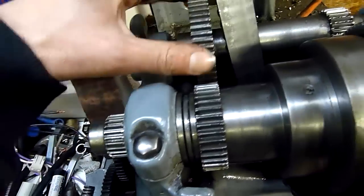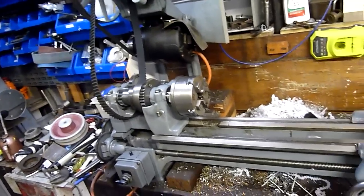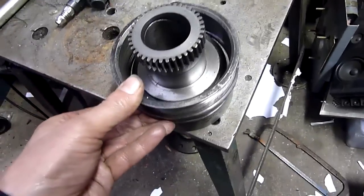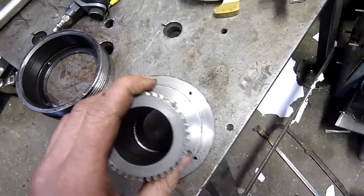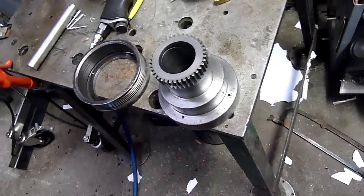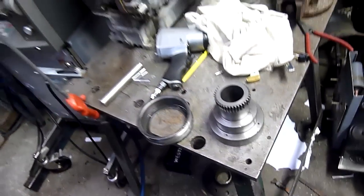Same with the back gear teeth - done a hell of a lot of work. 1941 or 1942 South Bend Indiana - it's a war production machine. I've transferred the bolt holes from the drive pulley placement and getting ready to tap them. Drilled them 3.2mm, I'll tap them M4 and use some high tensile cap screws. By the time I ram that annulus ring in there, it's not going anywhere and it should be almost completely concentric, or at least close enough. It'll definitely be better than it was.